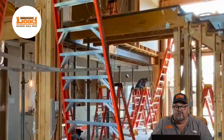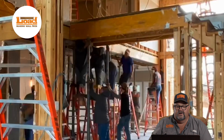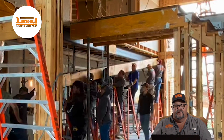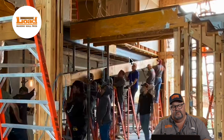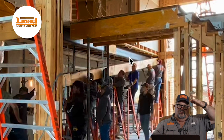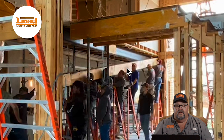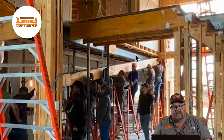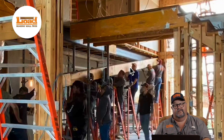Let me hit play and keep moving forward. You can see the first beam goes in, and then just a second later — there's the second beam. Notice the first beam does not have any packing material. The second beam has wood packed in the webbing — in the space — for the family room side, while the first beam would have wood on the kitchen side of the steel beam where it ties into the ceiling joist. That allows us to roll sheetrock down and over, and if you don't have that wood on there, the sheetrock guys complain because they don't have anything to nail to. We don't want anyone complaining on our job. So the second beam goes in, and now the guys will proceed to come down and weld the underside.